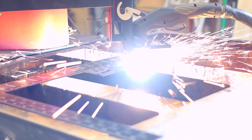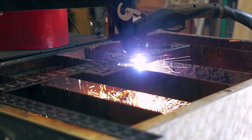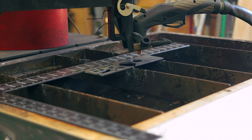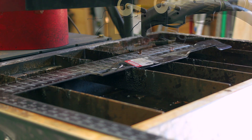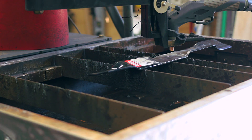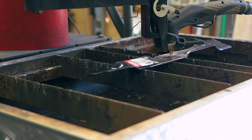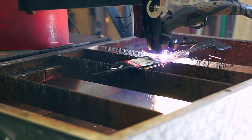It literally took me all of five minutes to get Fusion 360 started up, model the shape out, export the G-code, and have it on a USB stick. So in this case it was a much better option. We will cover useful aspects of the simple trace in a future video, and times when it is good to use it, but in this case it was just quicker and easier to pop into Fusion and draw it up.